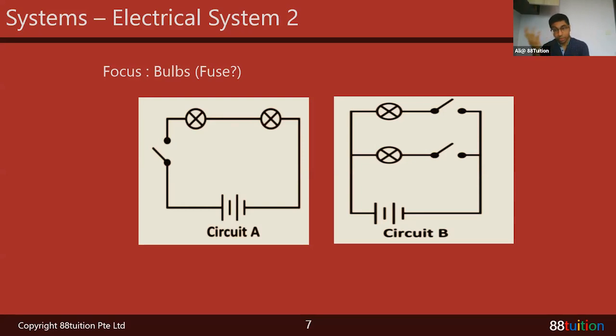And I tell you, hello, Mr. Brandon, hello, Miss Shanice, hello, Miss Chloe, you don't have to worry about the circuit I connected in parallel. If at any time one bulb blows, all you have to do is change that bulb, but the rest can still work. Whereas if I connected in series and collected your money, I cheated you, because one fine day, one bulb is gone, all bulbs gone. Then your kitchen will be dark for cooking and you cannot see anything.